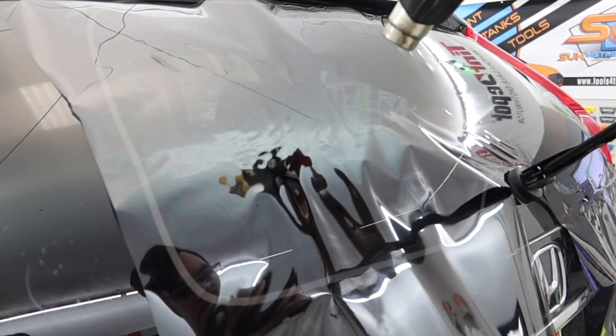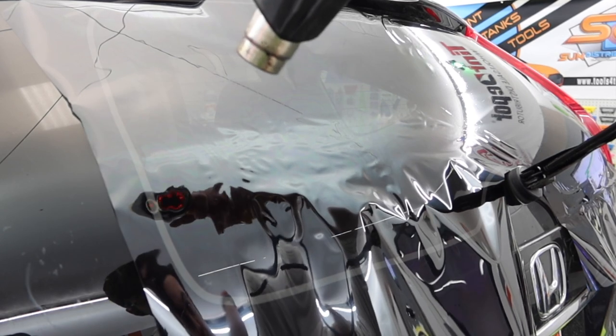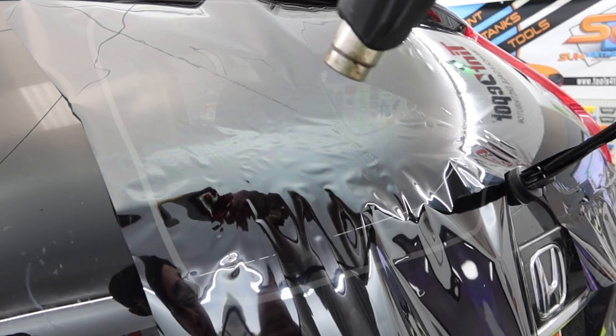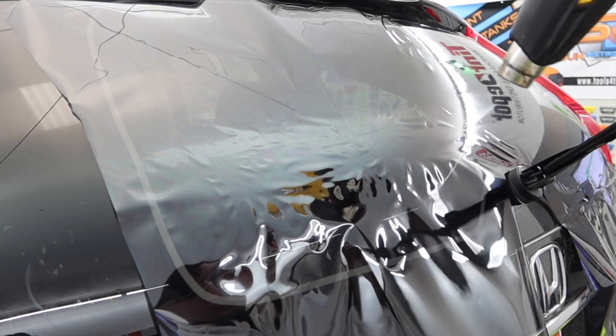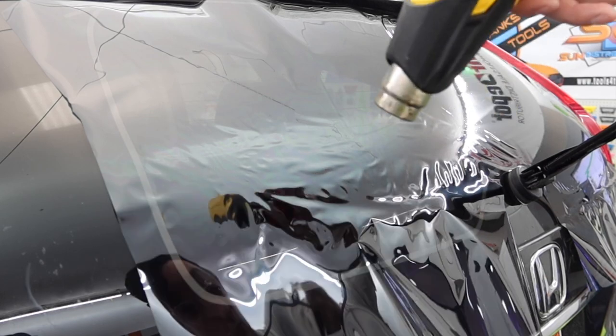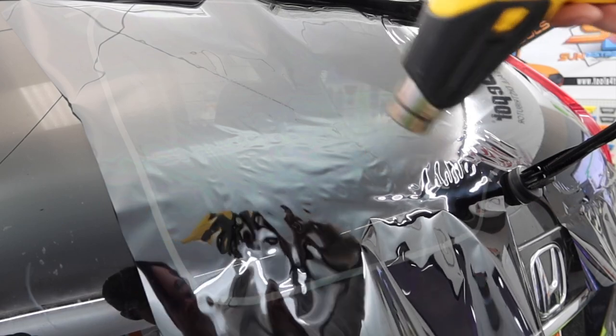With a window like this, I'm making little circle motions with the heat gun — it just helps to keep the heat moving evenly. The Wagner heat guns focus a lot of heat in one spot, so they get nice and hot. They're nice little heat guns, but you don't want to focus too much heat in any one particular spot. Just work your way back and forth.